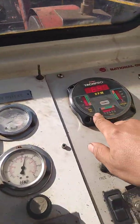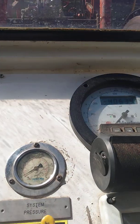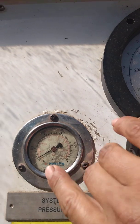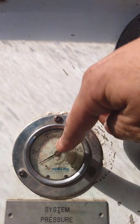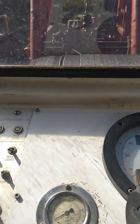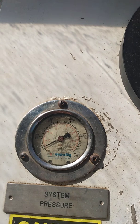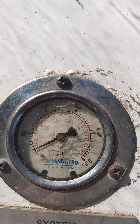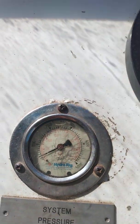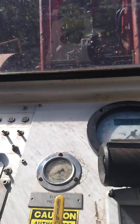Some people recommend going up to 1,000 RPM. I just keep mine how I'm rolling. Whenever you tag fluid, I don't have much pressure on it now because I'm still light. This is a quarter inch line, so it's going to be light at first. But it'll start climbing, and then once you tag fluid, you'll see that needle drop. Works very similar to a weight indicator.